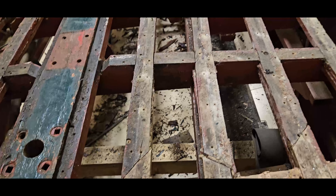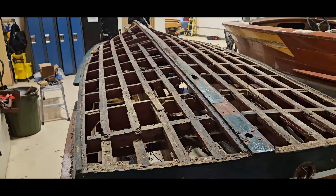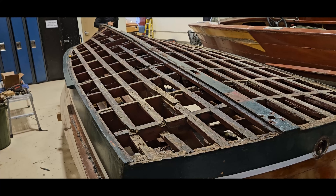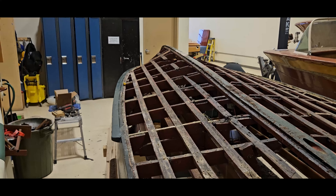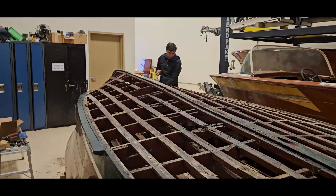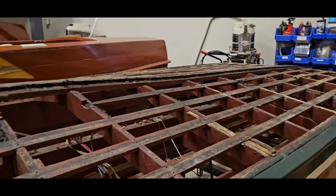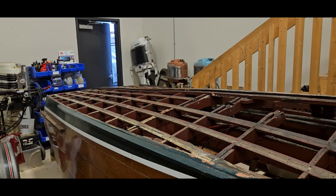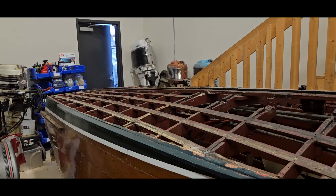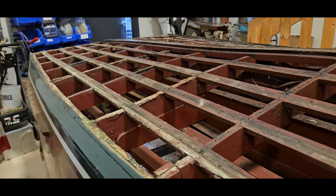The next step is going to be fairly simple: Artem and I are going to remove the battens from the framework, get this all cleaned up, sand everything down nice and smooth, and then we can completely assess the exact parts we're going to have to repair in order to put the bottom on. It's essentially just a straight piece of wood that lays down, and once it gets a little bit too tight where we can't bend it, we bring out the steamer. The next part is going to go pretty quick. If you watch this series from start to finish, you'll realize the majority of the work was actually stripping the interior — fairly similar to vintage automotive cars of the same era.